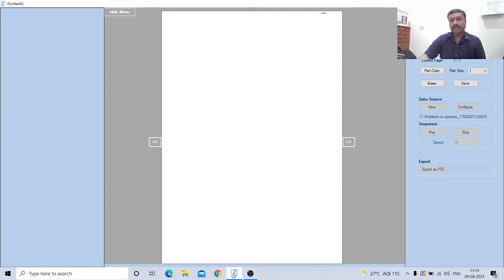In the last class we dealt with the bolt value for ordinary bolts, how to calculate the number of bolts, and how to calculate the efficiency. In this class we will continue with butt connections along with the packing plate and the recommendation given by IS 800. I will also teach you how to determine the bolt value of the HSFG bolt system. Okay, the next problem,